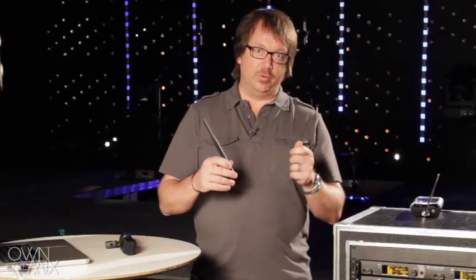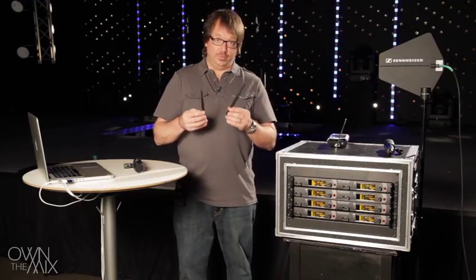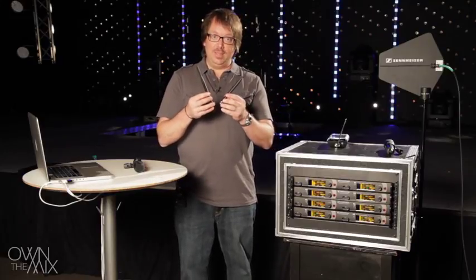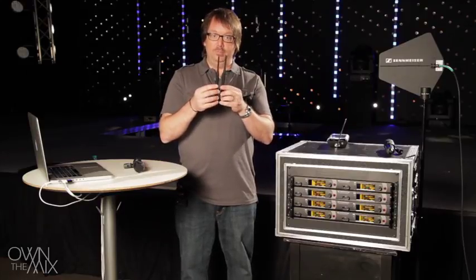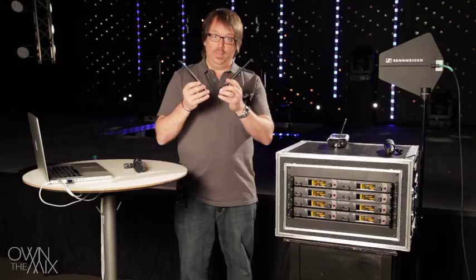As the antennas get closer together or extremely close together, we don't get a good diversity effect because they're for all intents and purposes in the same place in space. So we want to spread them out. When setting up a diversity receiver using the rod antennas that come stock, we put them on the back of the receiver and splay them at an angle — usually 90 degrees or something like that. We certainly don't want them parallel at any angle, as parallel just doesn't help. We get better reception when they are at different angles.